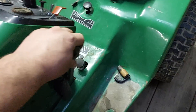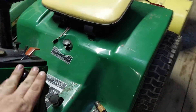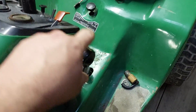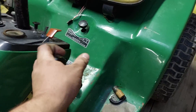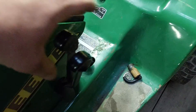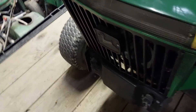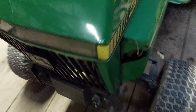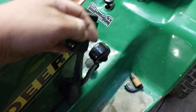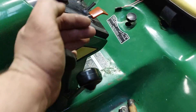These are your hydraulic levers. I've never had a mower deck on a 317 so I'm not 100% sure on this. I know the outside lever does lift the tiller and I assume the mower deck too. Both of them run your two sets of front hydraulics. This one has float — it's got just your hydraulics — and if you push it all the way forward it stays; that's float.